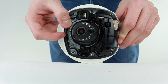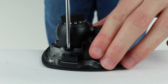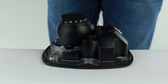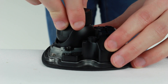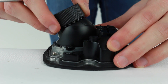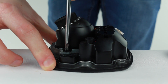After securing the camera into position you can connect it and get a live image up on a nearby computer. Once you can see an image it is likely you will want to adjust the viewing angle of the lens. To do this simply unscrew the hex screw next to the lens, then take the lens adjustment tool and stick its two little prongs into the holes at the top and bottom of the lens. Now you can adjust all three axes of movement: rotate, pan and tilt. Once you have the image on your monitor level or in the desired position, simply tighten the hex screw to lock into place.